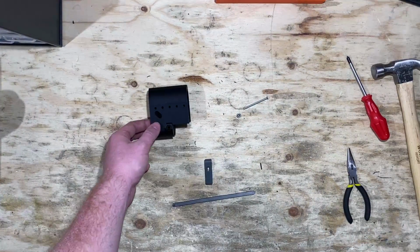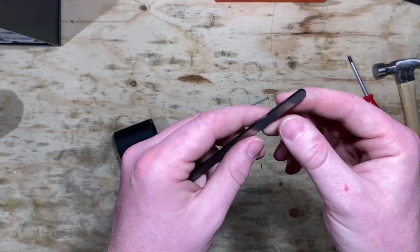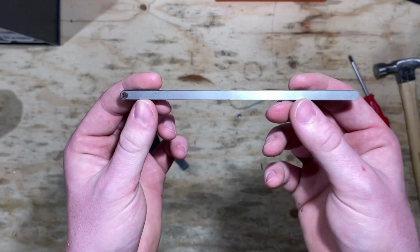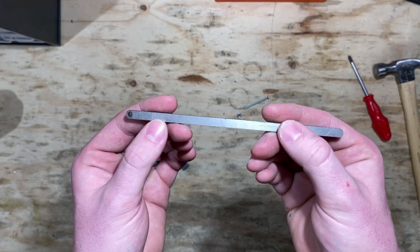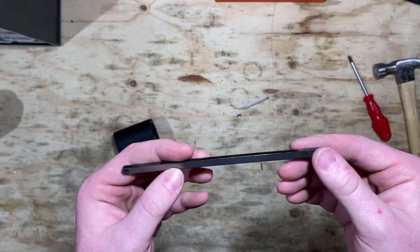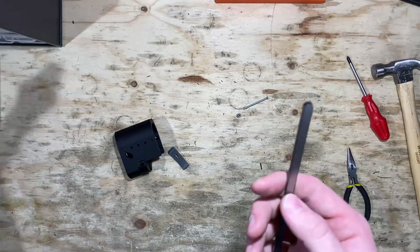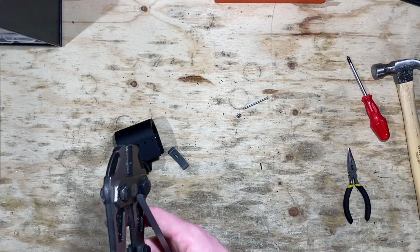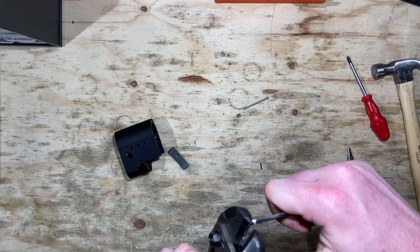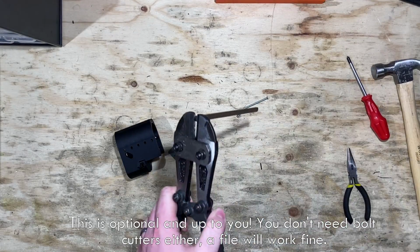Okay. What we're going to be assembling next is this part. I believe it's called handle A. Now, something to note is the trigger rod as is will give you a pretty sensitive trigger on the Spring Thunder. It'll be almost a hair trigger sometimes. So something we like to do here is just shorten the rod ever so slightly. You can use these bolt cutters real quick and snip off just like 1/8 of an inch or even less.